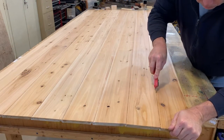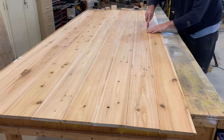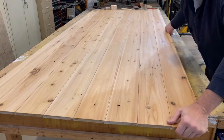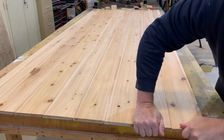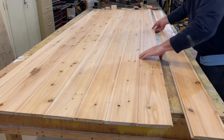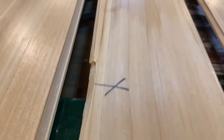Here I am after the first coat of polyurethane trying to separate the boards. I carefully cut along the seam at a depth of about one eighth of an inch to make the separation possible, then very carefully moved the wood back and forth to get them to release. Here are all of the broken tongue pieces — about 5% of the boards were damaged. Dumb mistake. Not a good start to this project.